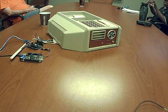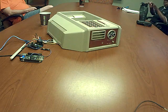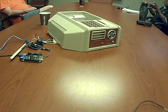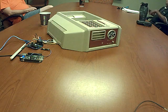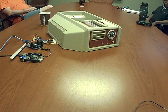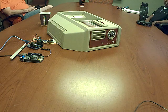Okay, you're talking about an Ethernet cable? Does a regular Ethernet cable work, or do you need something special? Regular Ethernet going into your router? That works. You're going to have to restart the BeagleBone so that it can get its IP address. They talk a lot about straight through cables, like a regular cable won't work. If you connect it to a router, it will. If you connect it to another computer, it won't. Routers handle both ways usually, your crossover or straight through. Crossover cables are for connecting it to your computer.